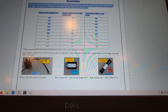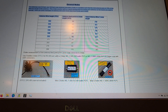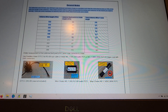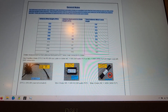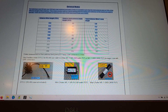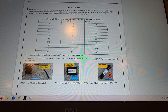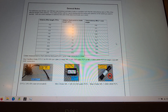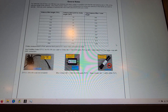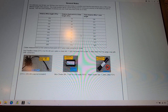Bottom line: 155 feet of wire. I put eight snap-on chokes at about 66 feet on the coax, giving me a total of about 221 feet from where the beads snap on to the very end of my 155-foot wire. The antenna is in an L-shape — about 70 feet vertical and the rest horizontal. That's what I did.